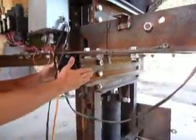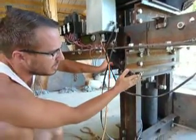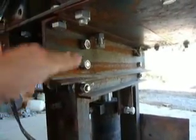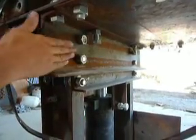Item number two: the compression chamber where the bricks are pressed is currently supported by U-channel. For the same reason — ease of fabrication — we'd like to replace this with half-inch plate with welded-on supported gussets, specifically at the area of compression. A sketch of that design is right here.